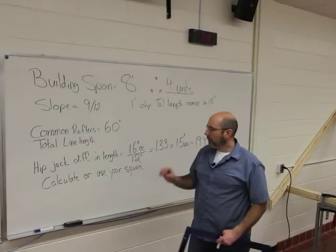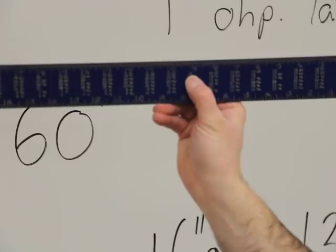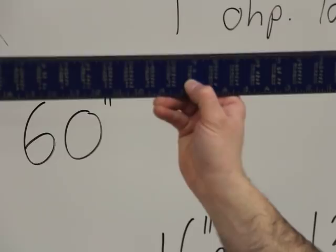If we go to our framing square and look underneath nine — maybe Travis can zoom in here — here's our framing square for a 9/12 sloping roof. The unit line length for our common is 15 inches, unit line length for our hip is 19.21 inches, difference in length at 16 inches on center is 20 inches, and difference in length at 24 inches on center is going to be 30 inches.